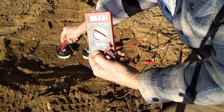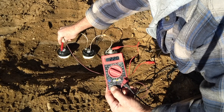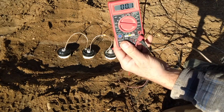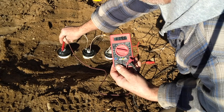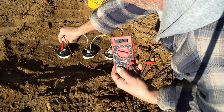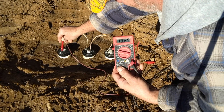7.17 volts — so it's working. Trying the milliamp reading, which will probably be less than what we had inside because the earth battery isn't quite as powerful as these little cells. It goes down first but then starts going up again. I think some of these other batteries are just pushing juice through the earth battery. Coming up to 132 milliamps.